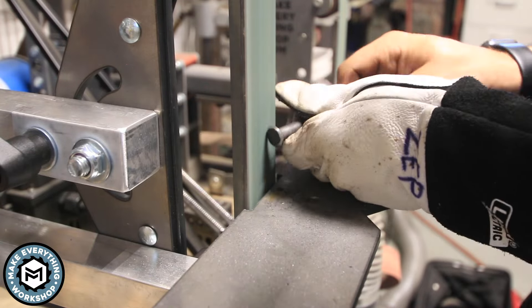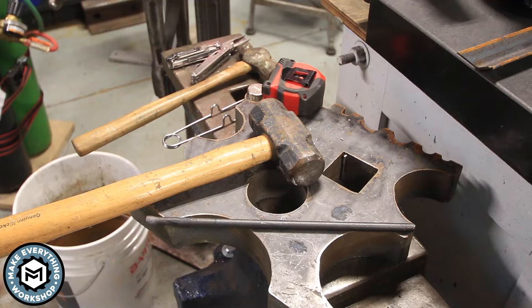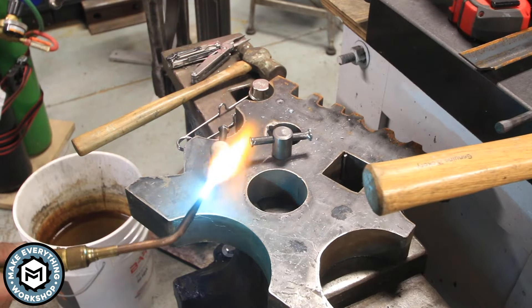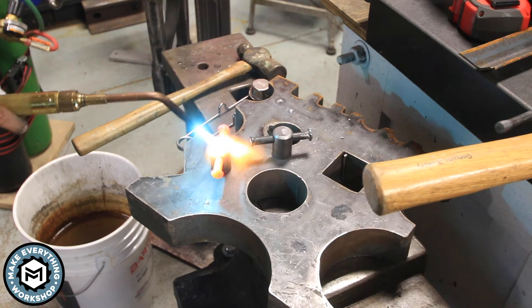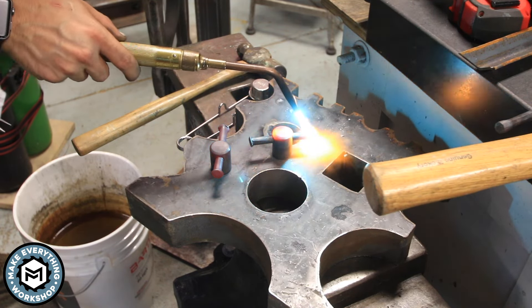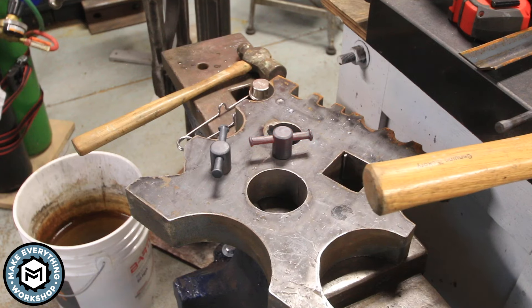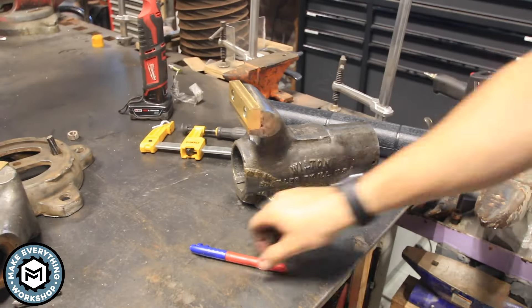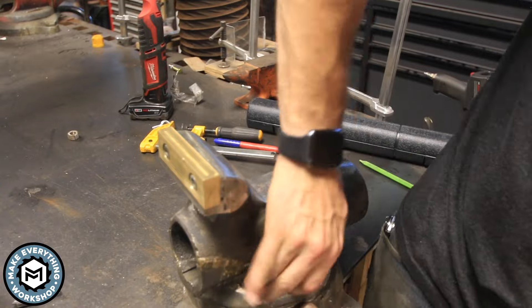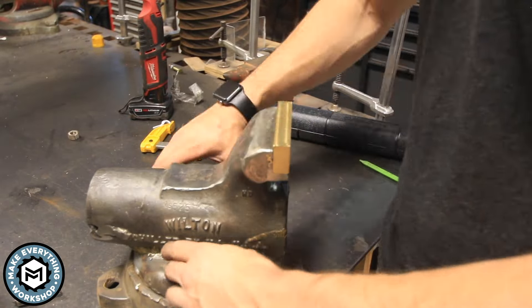Once cleaned up on the grinder they looked perfect. The other benefit was it allowed me to have a pretty long post to use as leverage to tighten the swivel down, but also kept them really slim because that one-inch screw post is pretty close to the vise body. Over on my 2x72 grinder I'm just cleaning up the edges and making these things look a little cleaner. I'm definitely not a blacksmith but they came out looking nice enough. I actually went ahead and heated these up red hot and let them cool — a trick I learned from my friend Paul Pinto, a blacksmith you should subscribe to: when you have milled or ground material, if you heat it up red hot and let it cool it'll look as though it was forged that way, blending in machining marks. Cleaning them up with a wire wheel gets a little of that scale and oxidation off. A little test assembly confirmed these things work — they needed minor tweaking where they hit the vise body, but just a little time on the grinder and reheating and everything worked out — they get super tight and totally lock the vise in place.